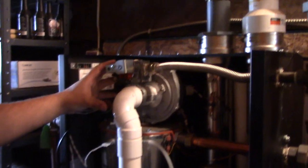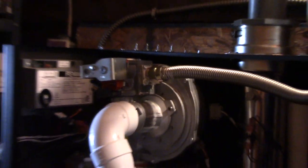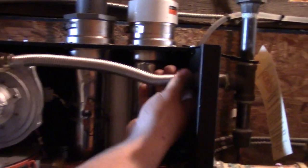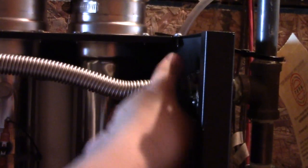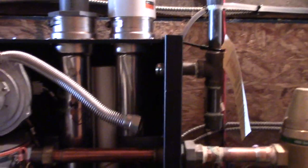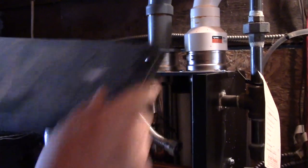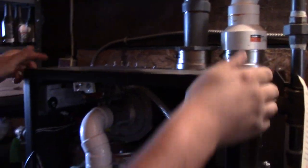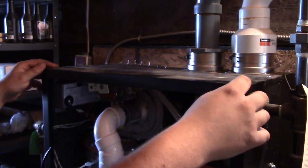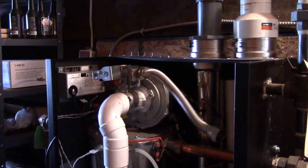This is your combustion blower and burner assembly with the gas valve. To remove this, there's a gas flex connector here — you can just break this free with a wrench, which we've already done. There's usually a lid that sits here; it comes off for easy access with four Phillips screws. Certain models like the SL115 have three thumb screws that just unthread, and this pops off to give you access to the internals.